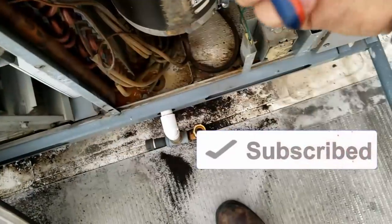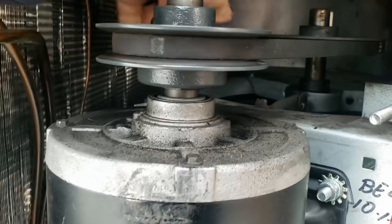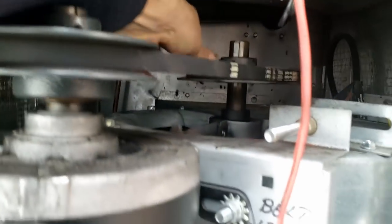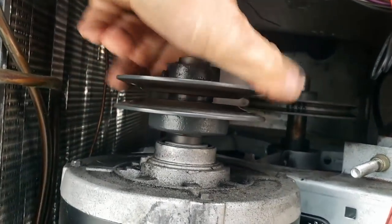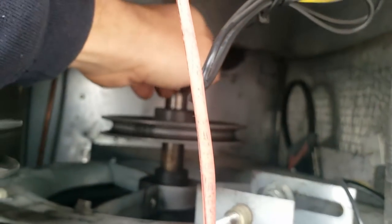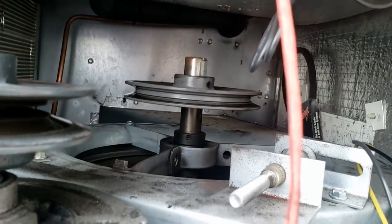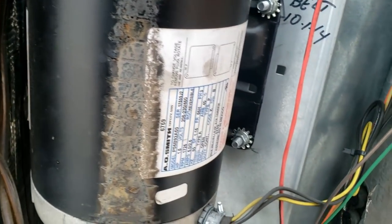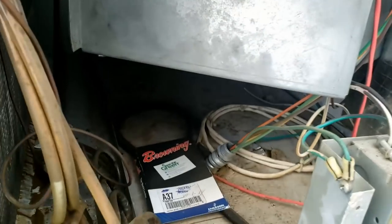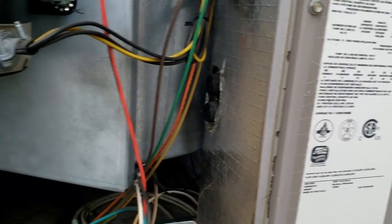Let's see if we can get this thing broke loose just to get it running for them. The bearings are gone — holy cow, I don't want to take this belt off. That thing is shot; got to come back for that. The regular blower bearing seems fine — I don't have any play on it. Seems to spin fairly good. We're gonna need to change that motor though — that motor's had better days. Bearings down here feel good on it too. This is a Johnson unit — didn't know they made a unit like this.